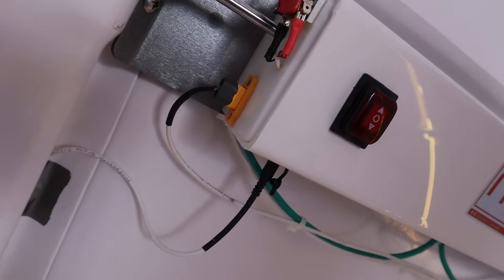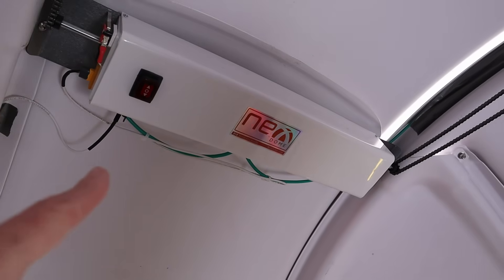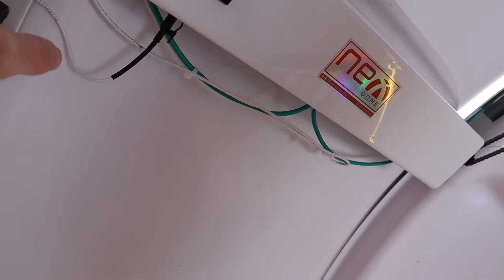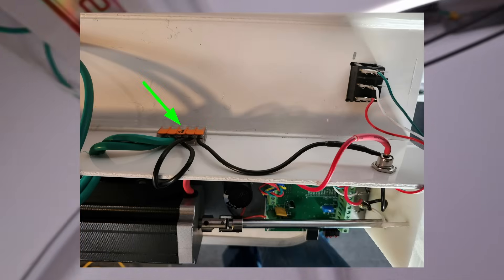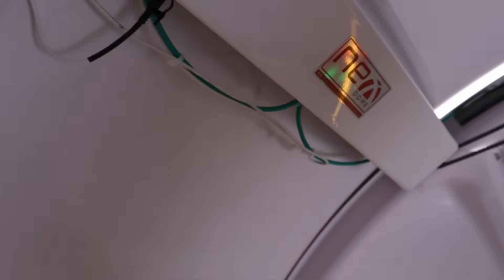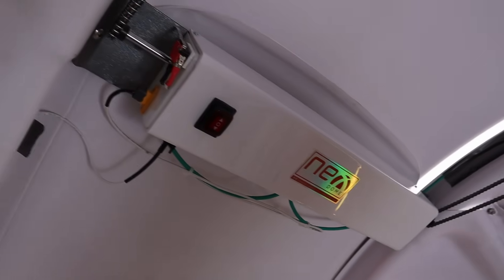Inside the assembly where the negative line is, I split off from that line. There's a steel plate that runs all the way across — the stepper motor and controller are both mounted onto it — so now that steel plate is grounded. The two green wires you can see are grounded off that as well. I also grounded the chain rail mounts on both sides since those are metal too. Now I have three relatively large metal surfaces with a direct path to the ground rod outside.